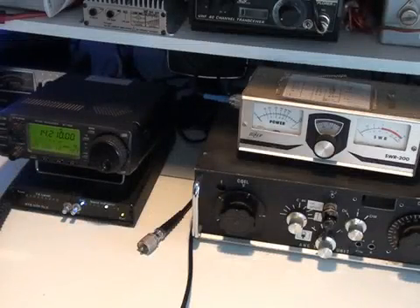One thing to be very careful of is that you don't transmit while the RxBridge is in circuit between the transceiver and the tuning unit. That would cause a considerable amount of damage to the internal workings of the RxBridge.